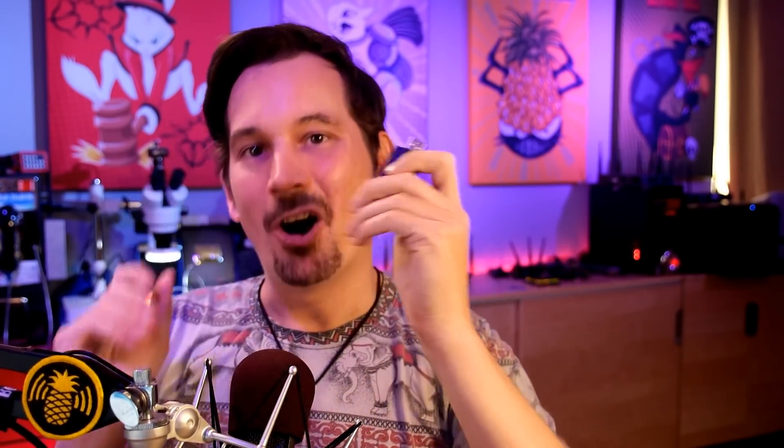If you're a seasoned hardware hacker, we're going to be talking about getting serial through UARTs on devices, so you may already know. But if you're not privy to this secret within the hardware world, welcome, because today we're going to be getting serial access on our Bash Bunnies. You're probably thinking: there's a dedicated serial console in arming mode. And yes, you're absolutely right — it's a soft serial by gadget.